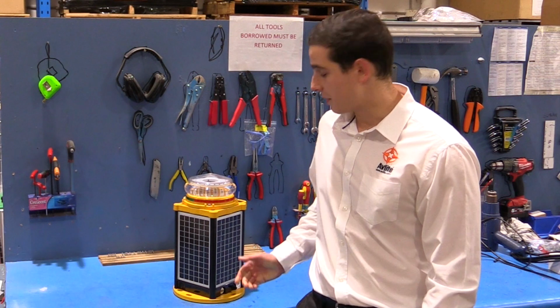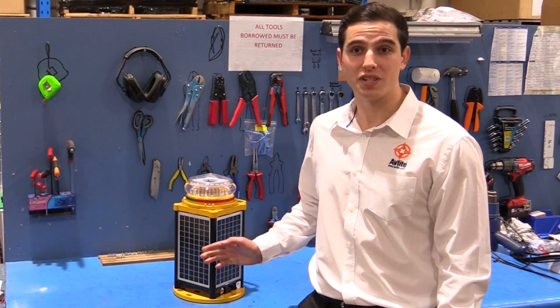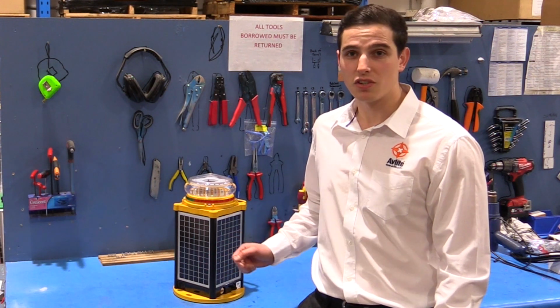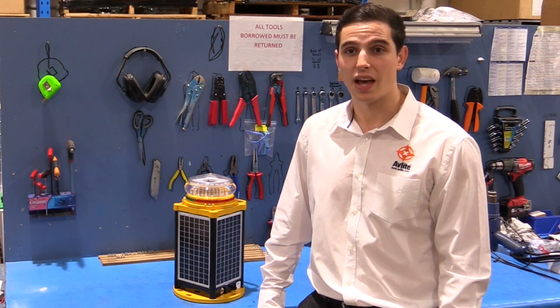Occasional cleaning of the solar panels may be required. Using a cloth and soapy water, wipe off any foreign matter before rinsing the panels with fresh water. Inspection of the battery should be performed at minimum every 3 years to ensure that the charger, battery and ancillary electronics are functioning correctly.